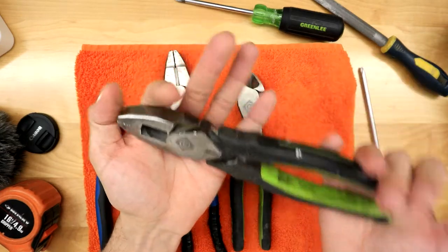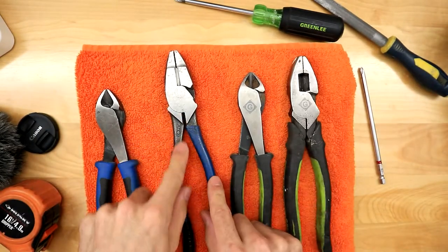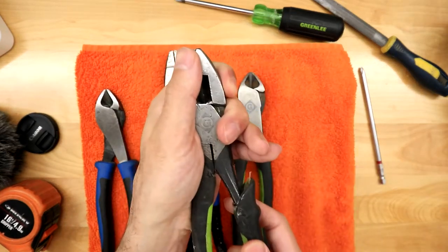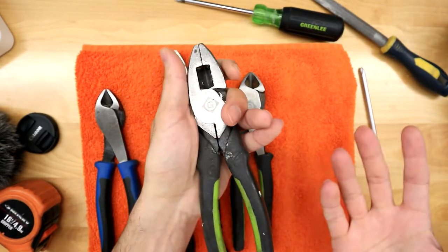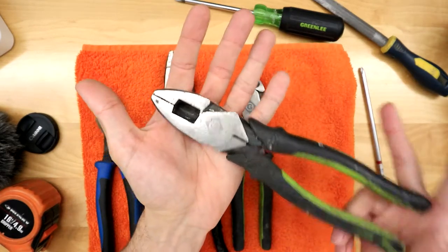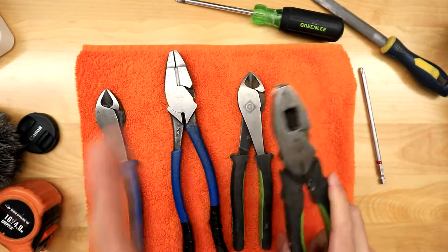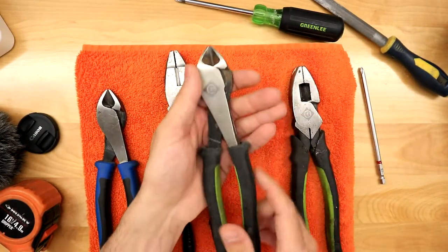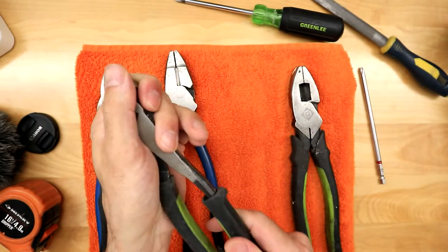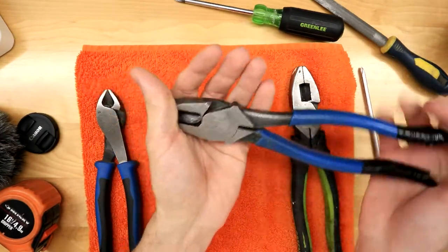I think the Greenlee pliers are great — I really liked the insulation grips. Over the years I also purchased some Kleins, and the Klein insulation grip also started to slide down. Interestingly, sometimes it was useful to pull off the insulation grip when doing slab work — you could actually use it to knock out Carlon boxes. The side cutter issue was really just that they're straight and the insulation grips were a little cheap.